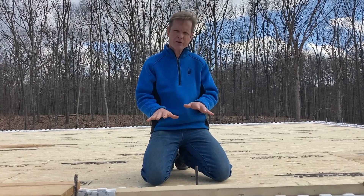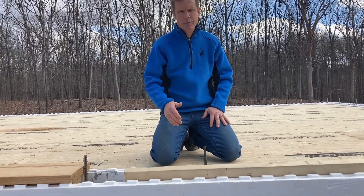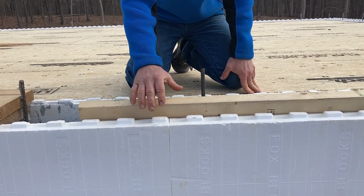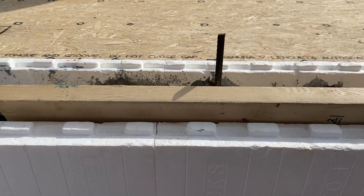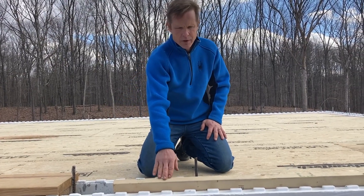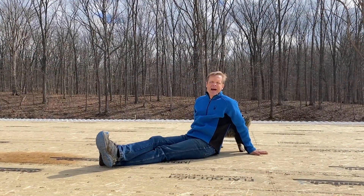If you're considering doing ICF, you really need to think about how a multi-story structure requires a lot of care for the second story. This edge here has been exposed for a couple of weeks and will continue to be exposed during construction — you can very easily damage these little styrofoam pieces. They'll dent and break off, and if that happens, when you put the fox block on top you will have weak points and gaps where concrete can seep through. So my builder wisely put some semi-permanent protective structures where they go in and out a lot, and temporary ones elsewhere so that when they're passing stuff over the top it doesn't cause damage.